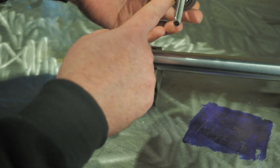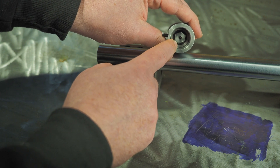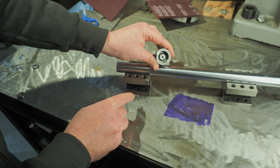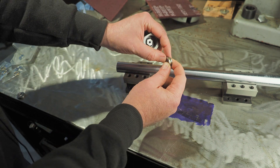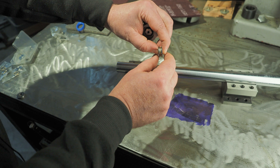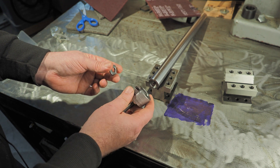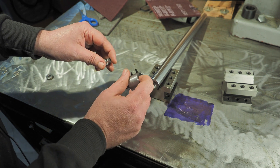Ideally I'd have a thrust washer in here with a little spring to create a little bit of additional preload. This isn't a super precision angular contact bearing. But when I've had this set up on the machine I've measured it and there's about 0.1 millimeters of give if I try to move this linearly. I think when the arm is moving in and out there's not quite that much heavy forces linearly on this. I've got these 8 millimeter by about 12 millimeter ones - they fit in there fine but they're pretty thick. And then I have these roller types which are considerably thinner, but I'd have to bore the hole out more. So I'm just gonna leave this the way it is for now and if I have any problems I can always knock it back apart and put the bearing and wave spring in there to give it the preload it needs.